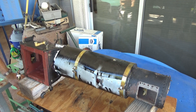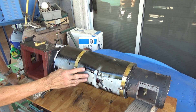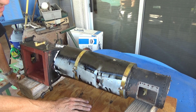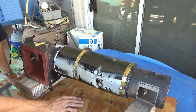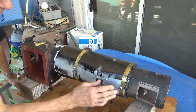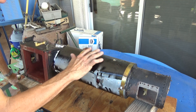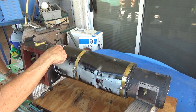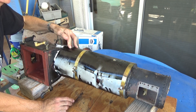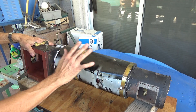Looking at this underside, I was just hard pressed to acknowledge that somebody is going to want to buy this locomotive, even though this is not terribly visible. You know, it's my work going back out, so I just assume not have this appearing to be the case coming out of my shop. So my plan would be to remove the wrapper and remove the bands, replace the bands, and then replace the entire wrapper — which requires spacer rings because I'm going to take the kaowool out of there, since I don't want that corrosion issue we were talking about earlier to be a long-term factor. So this whole reason is part of why we decided to just replace the whole wrapper assembly.